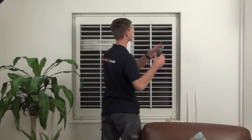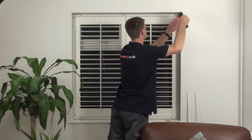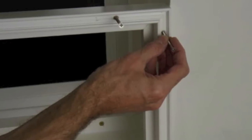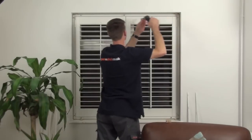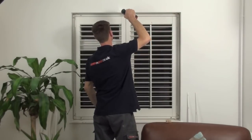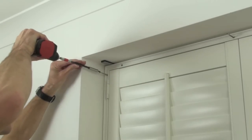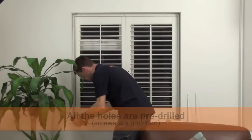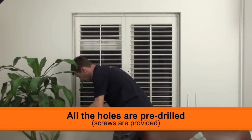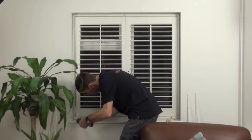You're now ready to screw the frame into place. When I put the frame together, I put the screws supplied in the pre-drilled holes to make fixing easier. If your window has a deep recess, make sure the chuck of the drill doesn't rub on the side of the wall — you can use an extension bit like this. Being able to fix the frame with the shutters in position is one of the key features of the Easy Fit frame. It makes the whole process really easy.